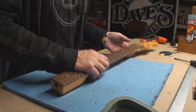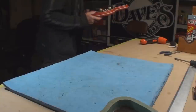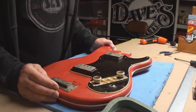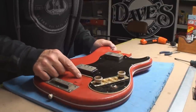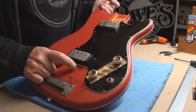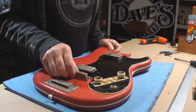We're going to set this aside for a while because it works, and then we're going to deal with the electronics — I'm not sure if they work, but we definitely have to open it all up, clean everything, and figure it out. It's pretty scratchy. This ground wire is so dicey — how would they ever hope that to work? Because over time the ground wire pushed itself into the tolex plastic and probably really wasn't making contact, especially on a floating bridge.